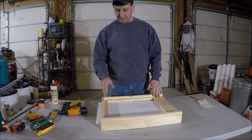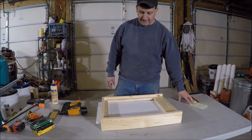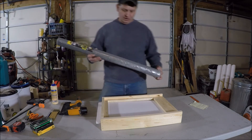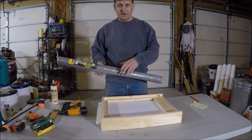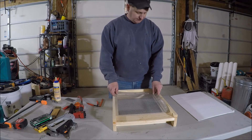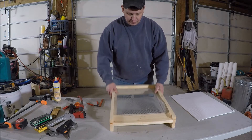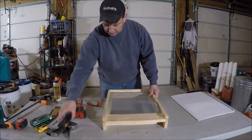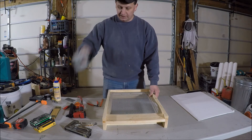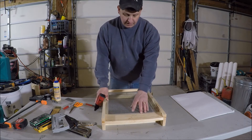The next thing we're going to do is cut a piece of eighth-inch, or number-eight, hardware cloth. The dimensions are 17 and three-quarter inches by 14 and a half. I'll go ahead and cut that from our roll of hardware cloth - I was explaining this in my other video. I'll unravel it, cut the hardware cloth, and show you how to install it. I've got the eighth-inch hardware cloth cut to 17 and three-quarters by 14 and a half - I'll have the dimensions in the cut sheet in the description.